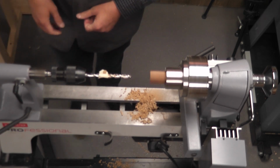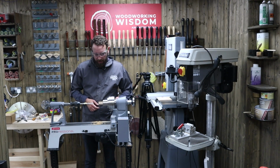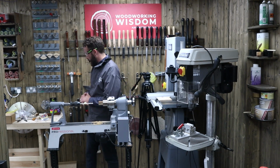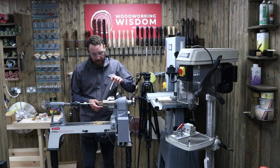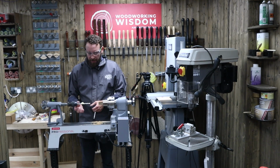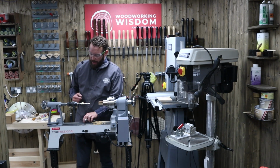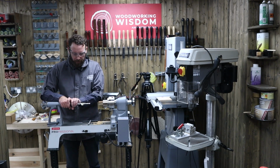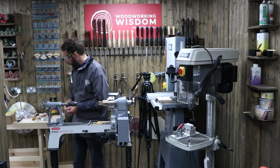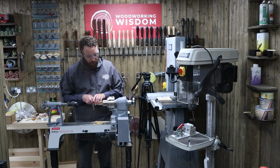Okay, so that's the drilling done. Okay, I'm going to turn that machine off. We've come right the way up to our piece of tape there, and let's drag that right the way back. For extra safety, if you think you may foul on the back of this one, remove that drill bit, and let's just do that anyway. Remember, this could be hot, so just be careful we're not touching it on that end. Let's pop that to one side on the bench, and then we can retrieve our blank.